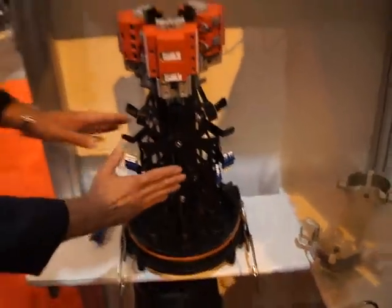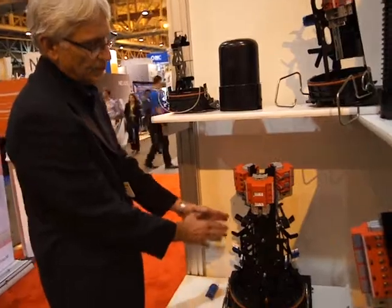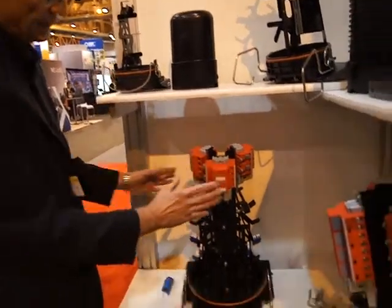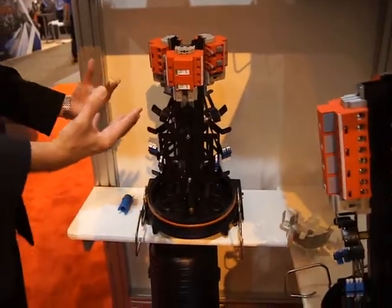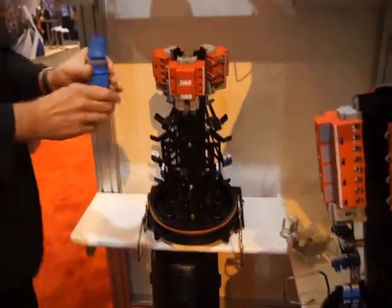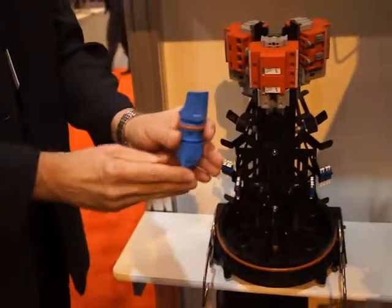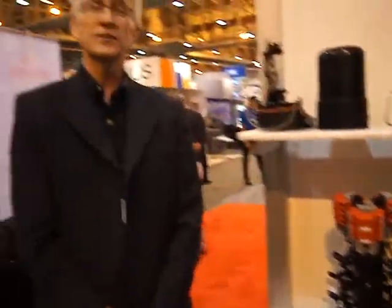Basically what happens is the entry port fiber and power cables come to the surge protectors in line. They also come to the fiber connectors and they await there for the jumpers to be input via our e-cam type cable assembly holder. So cables come through here. They're protected by a grommet. They slide through in the base. You make your connections. You snap the retaining ring into place. And then you have a completed connection ready for your remote radio unit.